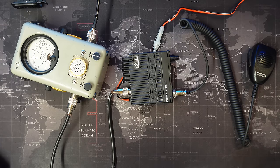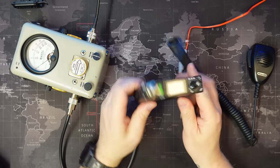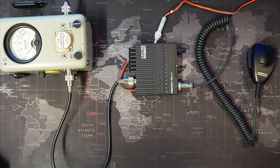Now, with President radios, generally, when they have a line between them on the PCB, that usually means that you bridge it, and if the two wires have a square box around them, then that means stick a 1K resistor in line. So as this has a single line, that is what we've done, but it doesn't seem to have had any impact. So if you know anything else about the Bill 2, I'm quite happy for this Bill 2 to be the sacrificial lamb. I will get another one for the collection, but this one can be modified and we can try different things on it. So if you have any further thoughts on how we can control that high power option, if you've got the service manual and you can provide a bit of additional information, then I can certainly try that on this particular radio.